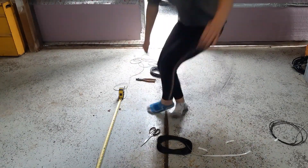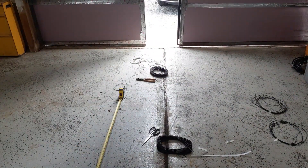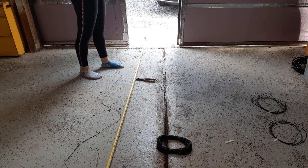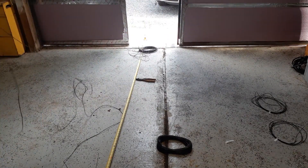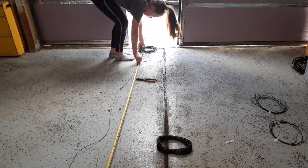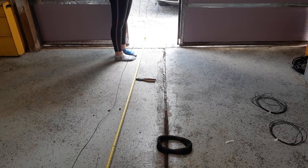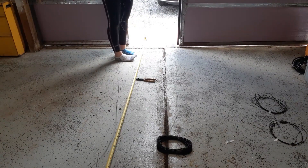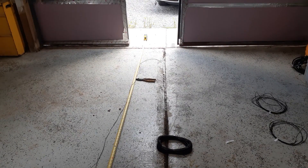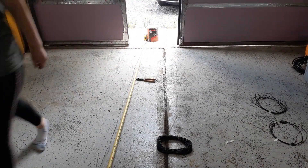I did have enough wire to do all three elements. The 40 meter element is the one I'm doing right now. I sort of went all the way up the tape measure and back down because I wanted to stay in frame. This was the one that I had some trouble with — I had to go back and trim it quite a bit. There were a couple of different numbers within the user guide. I will show you at the end how many inches below the guy plate the 40 meter element ended up being. You don't have to be incredibly specific about how long they are — you can always do a little trimming, and that's always an option. So don't stress about getting it down to the tenth of an inch.